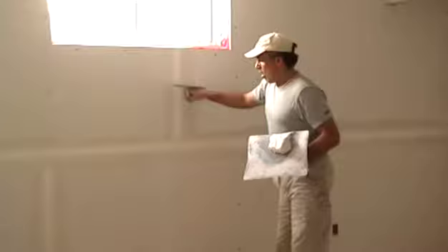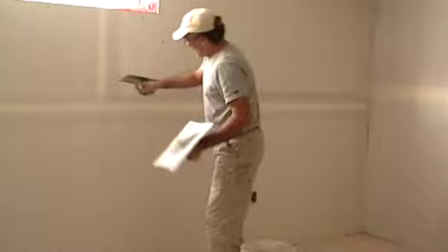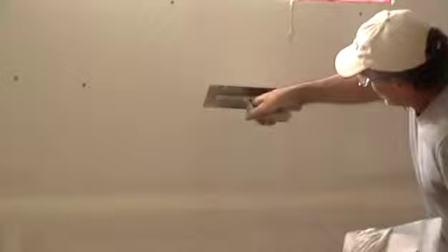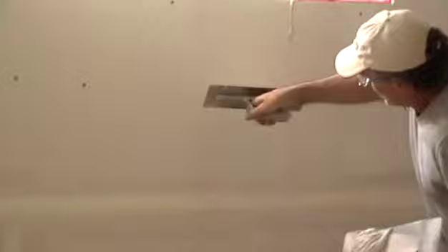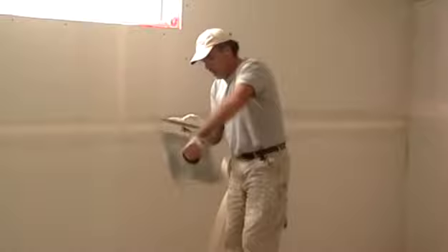Completely first coated tapered joint. Once that is done, these butt joints sit higher - a tapered joint doesn't bounce a trowel around. Part of my first goal is simply a trowel width on both sides. I'm laying it down and I want the mud to be there, then we'll reuse it as we go. Pushing the tip of the trowel against the board, then the back of the trowel against the board. Tilt the blade up. You can still see the tape, but we've got a little bit of mud on either side, which helps flatten it out - less shrinking in the second coat, less chance of seeing that hump later.